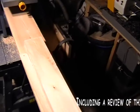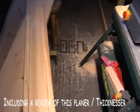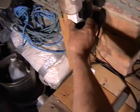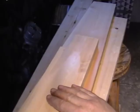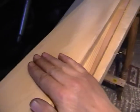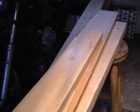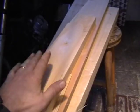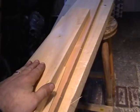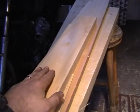And I'll take it off. You can just see there — it's actually on the second pass, but it's taking it off, it's flattening it, it's doing the job. So another little wind down on the thicknesser, and I think I've got that side nice and flat. Then all I have to do is unscrew it, flip it over, and the back face is the reference — it'll get the other face flattened parallel to it.